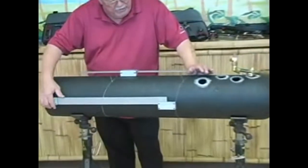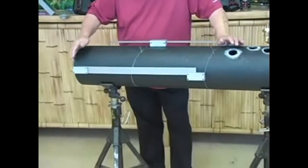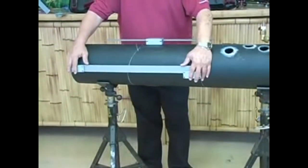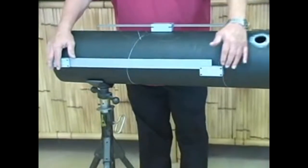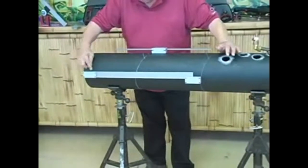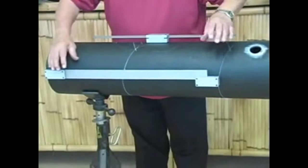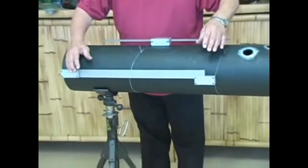We're now moving on to our structural and layout guides. Our straight torch guides have a 304 stainless rail. They're 2 foot long. They come with two strong 30-pound pull magnets. Guys, I've slotted these magnets on three sides, and that lets you do a lot of different things. You can put it on the end of your cutting rail. You can put it horizontal to your cutting rail. You can actually put it perpendicular to your cutting rail.